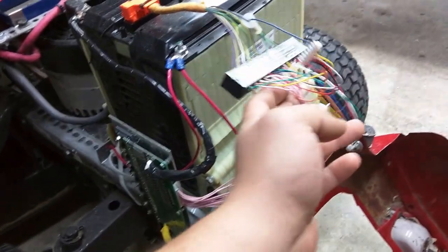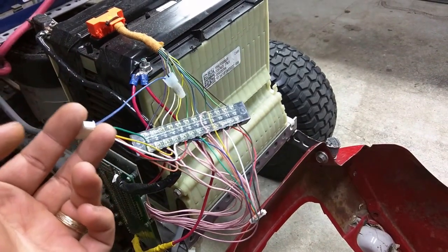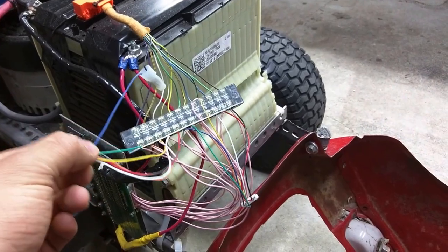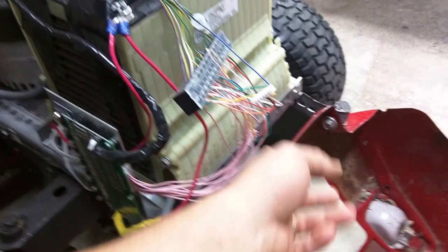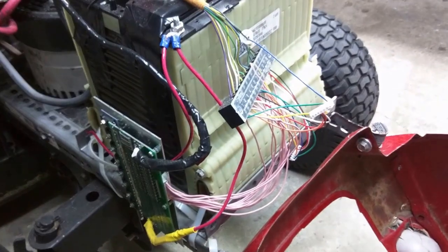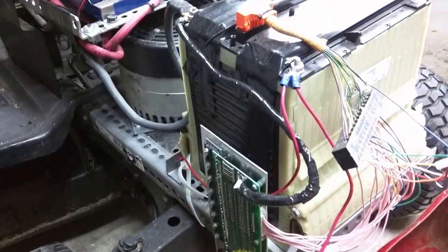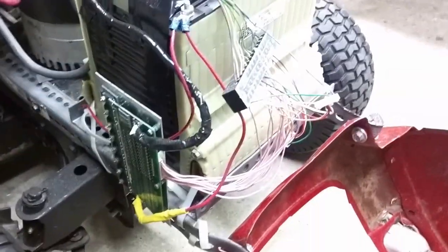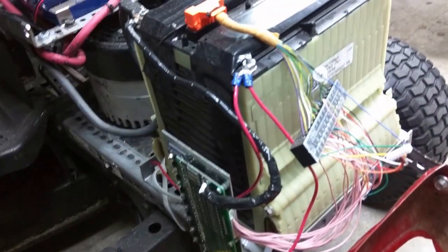And this here is the balance adapter. I soldered on these two connectors. I had them soldered at one point. Right now they're just hooked into this board here. So I made them into two 6S packs for a total of 12S. And this is a lithium manganese, I believe is the pronunciation, not a lithium polymer. However, it has the same properties of peak voltage and nominal voltage, and you can thus use any LiPo charger.